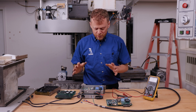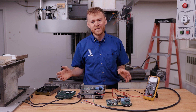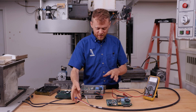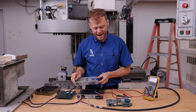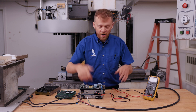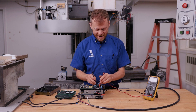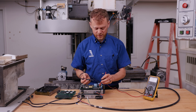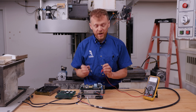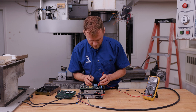So, troubleshooting amplifiers: you can swap them, but don't do it if you've got a non-resettable alarm — an alarm like amplifier fault — or if you've never gotten this alarm before, got it once, cycled the power, and you still get the alarm. We've got to check the motor wires to ground, the motor wires between them, and the motor and the amplifier. We've got to separate the amplifier out from the others, because if this one that we measured in the K ohms was in parallel with these, it's going to bleed across and they're all going to look bad. You want to see high resistance between the plus and the minus — the high voltage negative and positive. You want to see high resistance between the three phases of the motors, and high resistance between the three phases of the motor through the high voltage negative and positive.